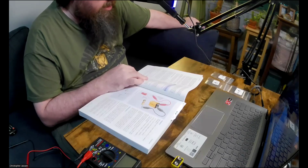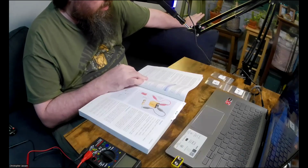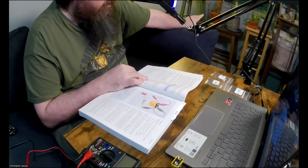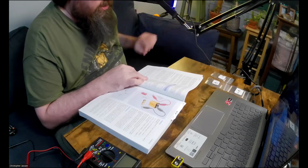For example, look at your 1.5K resistor. Its colors are brown, green, and red, which stand for 1, 5, and 2 zeros. In other words, 1500, which is 1.5 kilo ohms. A resistor with a group of 4 colored stripes is likely to have a better tolerance than 5%. The exact tolerance is not important for the projects in this book.